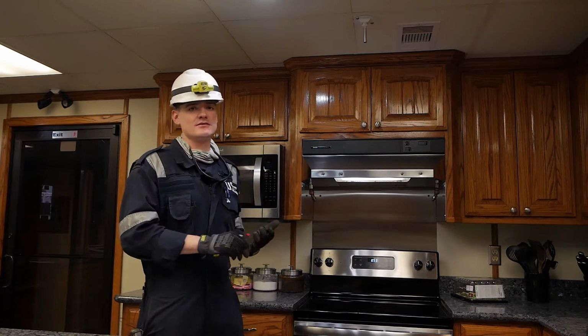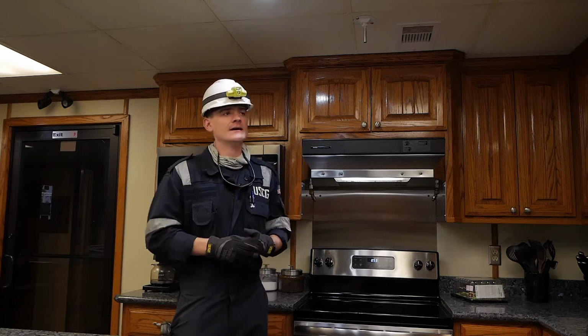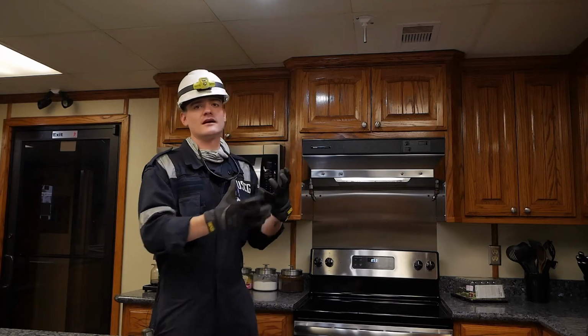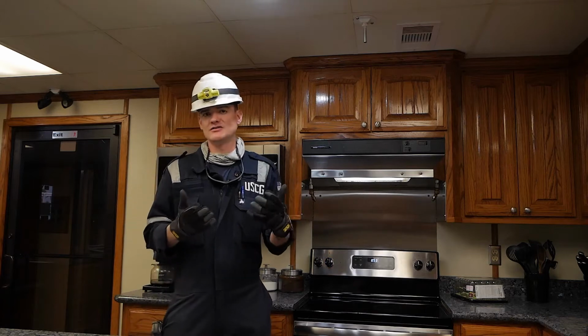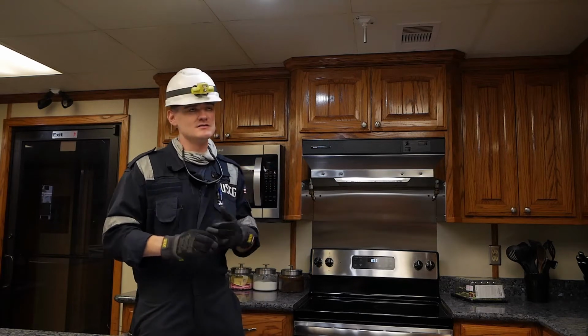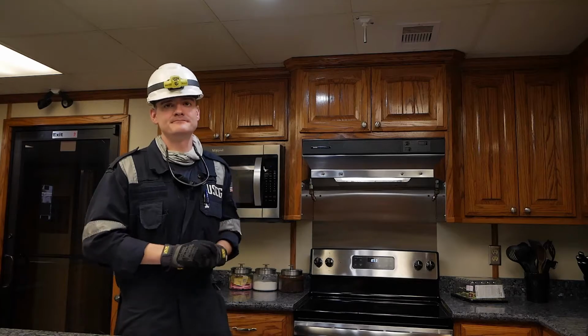You have certain smoke detectors that have to be approved to a certain type. This varies from vessel to vessel. But the main thing to focus on now is to ensure that when you come across a smoke detector or a heat detector or a flame detector, it's not an item that they might have just picked up at the dollar store, and that it is an approved type. You can find that within their paperwork of their annual inspections, and again on the unit itself, so you can verify that it's been approved.